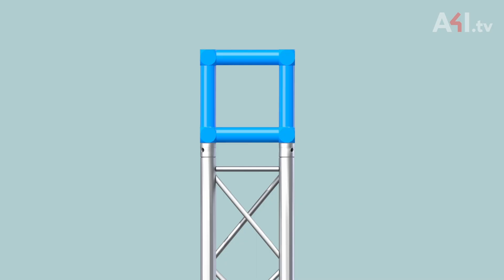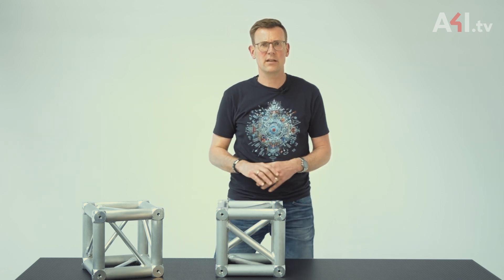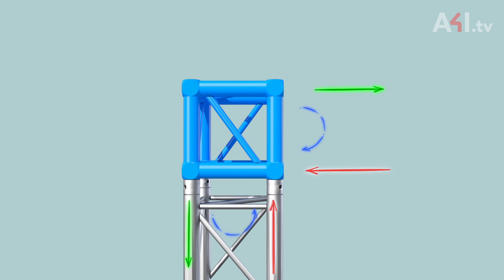If the cube did not include a diagonal, the tensile force in the upper main cords would cause the cube to deform from a square to a parallelogram. However, the diagonals in the cube prevent this displacement, as they would have to become longer or shorter, which would lead to compressive or tensile forces in the diagonals.